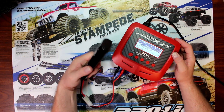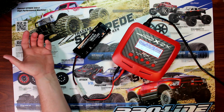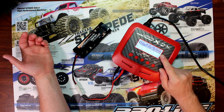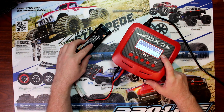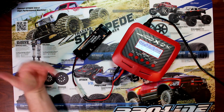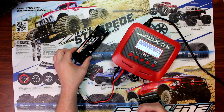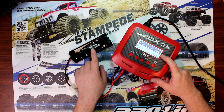You might see more depending on your battery — I've seen batteries rated at 3000 going close to 4000 inside. Every battery is a little bit different; individual cells will vary and might take more or less. This number tells you what's happening with your battery. For example, if this meter goes to 1900, it's telling you the battery reached 1900 milliamps instead of 1800 — that's good, you're basically getting a little bit more running time.